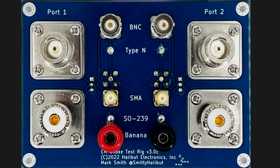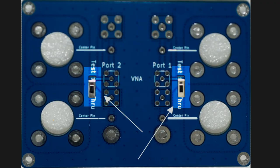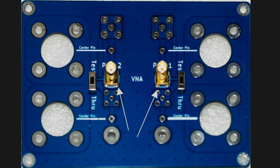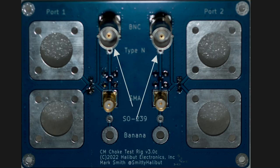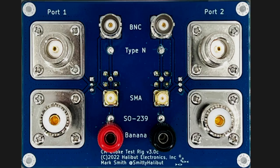Once that's done, you're finished. For me it took about an hour — it wasn't a big deal. Probably the hardest part was the first two steps with the switches. Use some caution with them because they're small and they don't take a lot of heat, so you want to use minimum heat. The rest of the connectors, like the SMA, are pretty durable, so not a big deal to install. Again, pay attention to the front and rear on this board — before you do anything, double check, recheck, triple check that you're on the proper side of the board.